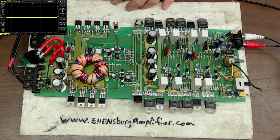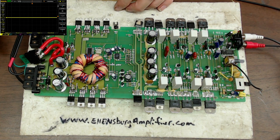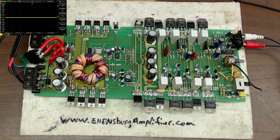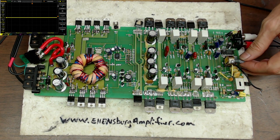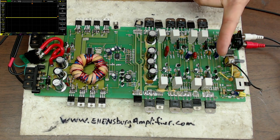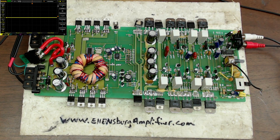That's what I wanted to achieve and accomplish. For all you guys waiting for the video on how I adjusted the circuit — I pulled out the original 18k resistors and replaced them with 200k resistors. It was trial and error, but the 200k value puts me in the 2 to 4 volt input range without sitting fully counterclockwise on the gain. Now I have full control of gain from zero to three-quarters, as you'd find on most any amplifier. I hope you enjoyed that — if you have any questions, let me know down below and I'll get to you as soon as I can. Thank you for watching, I'll catch you on the next one.